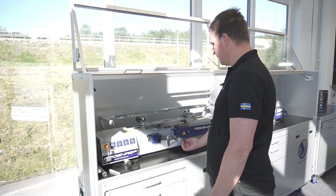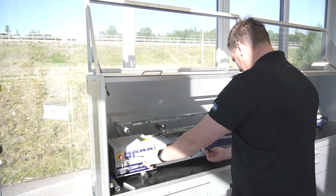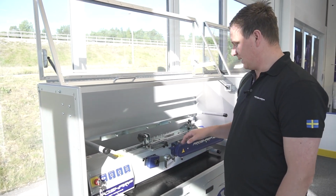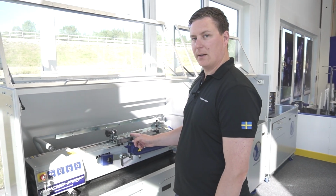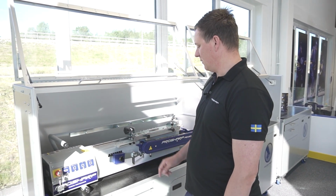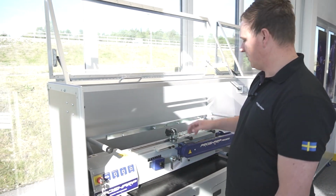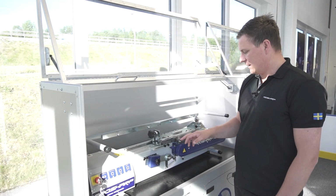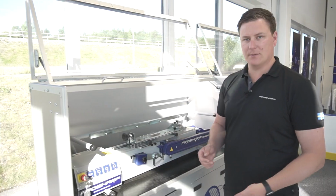You set the height on the heel, and then we check it, and we will profile further than the mark on the toe, just so you know, because of the shorter radius in front. And when you're satisfied with the height of the guide roll, you profile them. After that, you do the hollow.